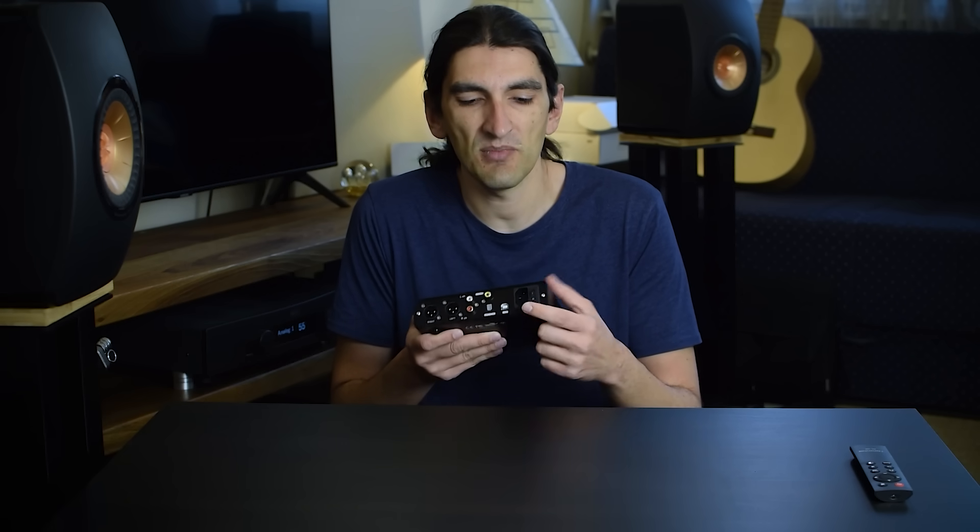The differences don't end there — it's a completely different device. The DA conversion chip is just one small part of a whole DAC; the power supply is a big part of it. Unlike many other entry-level Topping DACs that use 5 or 12 volts DC powered by a wall wart or small power brick, this one has an IEC inlet. That means it accepts 220 or 110 volts AC depending on your region. The entire power supply — AC to DC conversion, power conditioning, and power filtering — is located inside the unit. You just need a power cord.